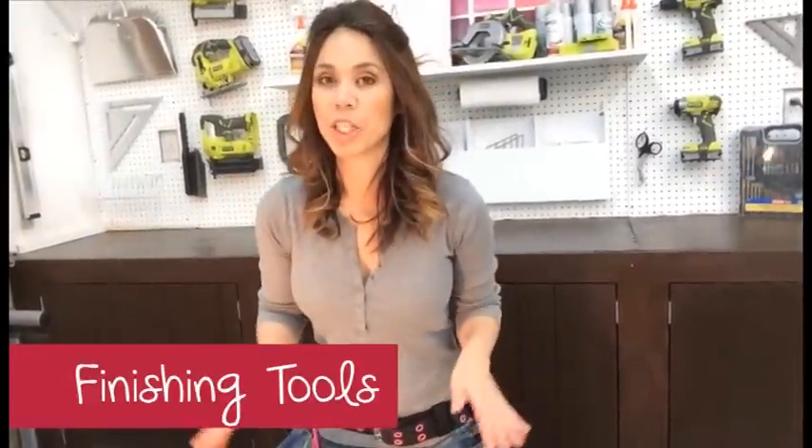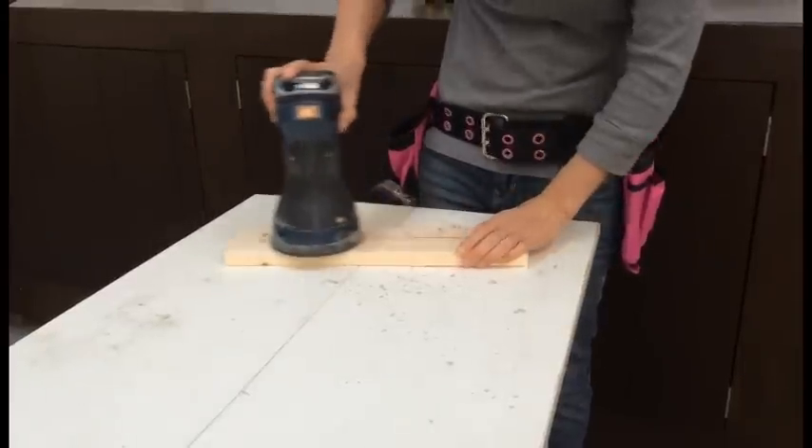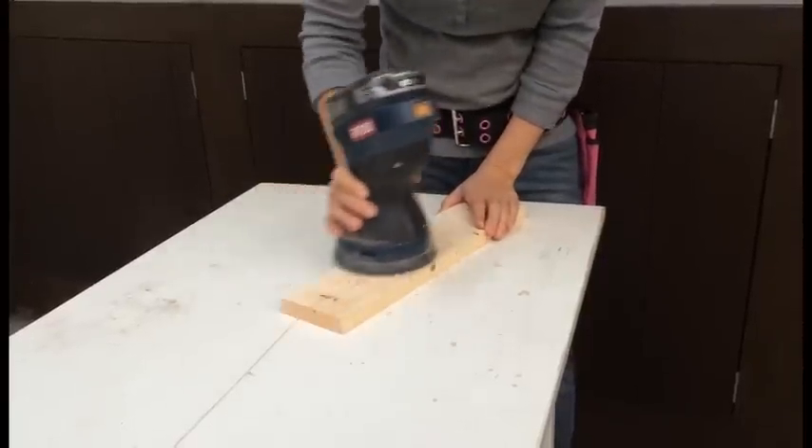Okay, so we've got cutting down and we've got attaching down. Now for finishing — you'll need a sander for sanding joints. I'd invest in a random orbital sander so you can quickly and easily do everything from removing rough patches to sanding joints and cut edges. It really is the most versatile of the sanders, and you can get away with fewer different grits of sandpaper with a random orbital sander. A sheet sander — especially one with a corner pad — can do finer finish work and reach into tighter places; it's nice to have, but not as essential.